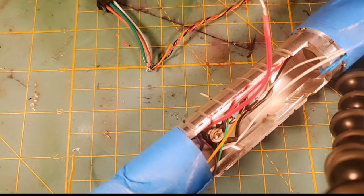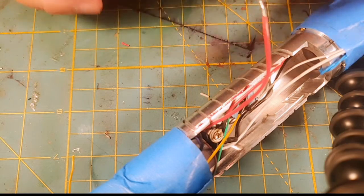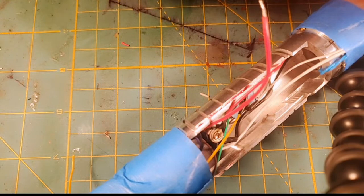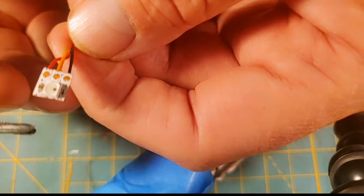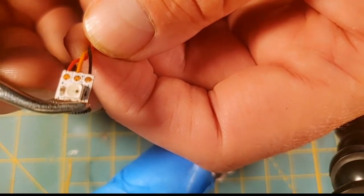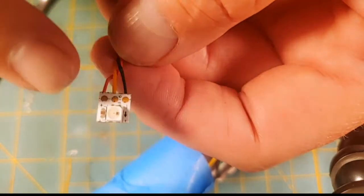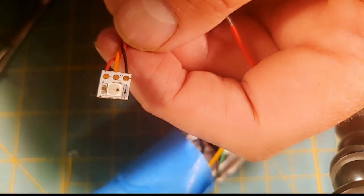Can you daisy chain accent pixels on same wires in different parts of the hilt and treat them as the same blade? You can, Cole. You can run one continuous. The thing is, you have to use the data out on the NeoPixel. And the way I wired this, you wouldn't have that. So, you know, how we cut this pixel, I cut the data line off. But you could still run your data line continuous off this data line to your next pixel, and that would work just fine too.